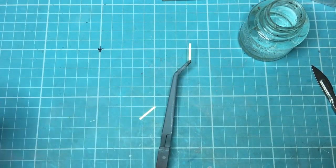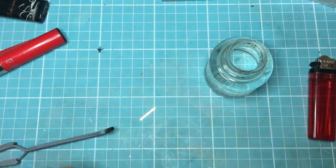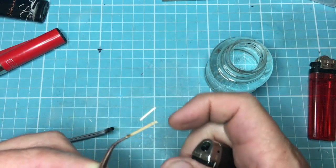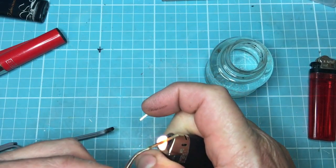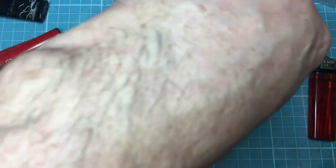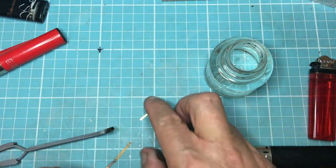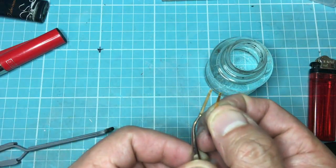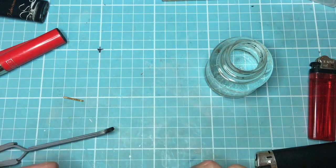When someone tells you just heat it up until it changes colour and that's it — yes, it does soften it to a certain extent, but you can get it really soft like lead if you do it properly. So I'm going to take a cigarette lighter. I found the lighter that works and I've used smaller tweezers so there's less of a heat sink. Watch now — I'll heat this with the lighter. The brass will start to glow red. There we go, starting to glow — and in the water. You can see it's changed colour, and that is now annealed and soft as anything. You can do anything you want with that.